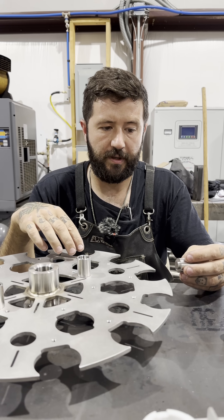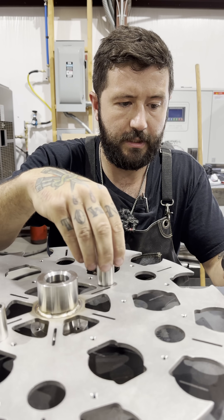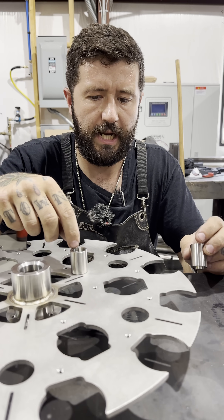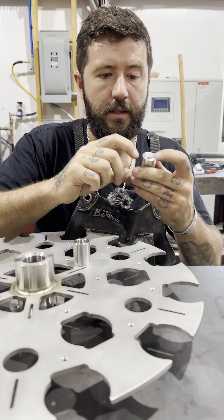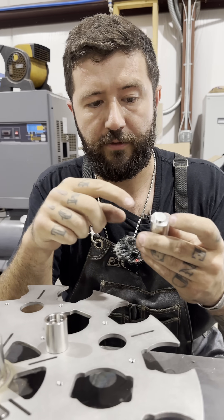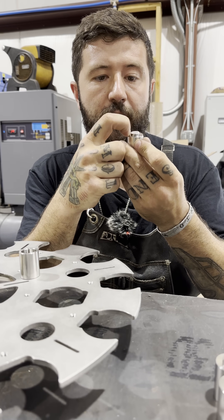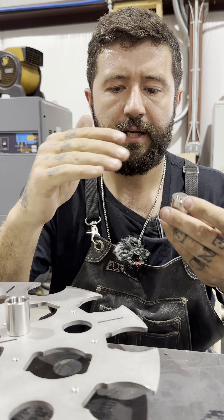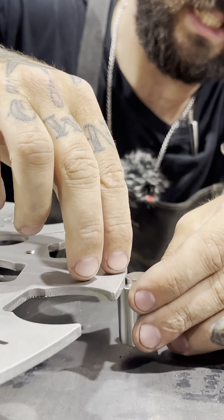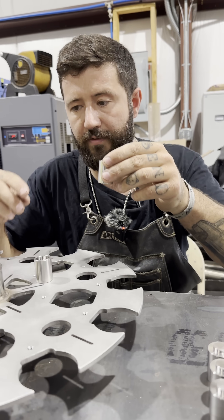We're coming into a little bit of an issue here with these wiper plates and these — I think these are magnet standoffs. There's one that goes on either side. The step here is not only a locator for the magnet holder in the wiper plate. This little standoff should be a few thou less than half of the material thickness of whatever this is going in, because there's going to be one on either side of it.